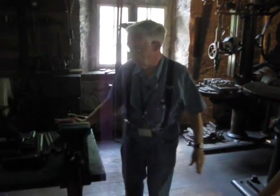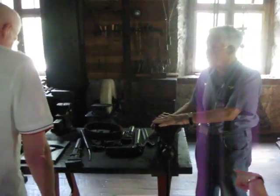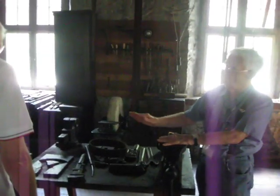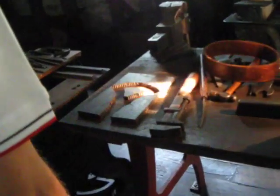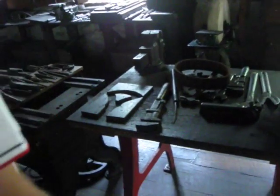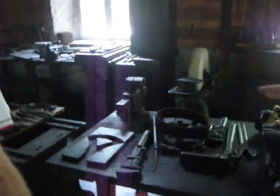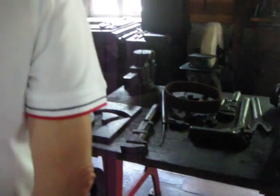They did a lot of hand work in the old days. They did not have a bandsaw or oxyacetylene torch for cutting curves in metal. So this illustrates what they did if they wanted a curve — they drilled holes all along the perimeter of the curve, then knocked out the middle, and then some very lucky person got out the file and made it smooth. It's kind of interesting the way they were able to make things.